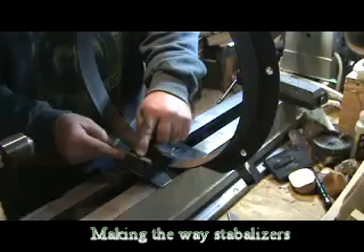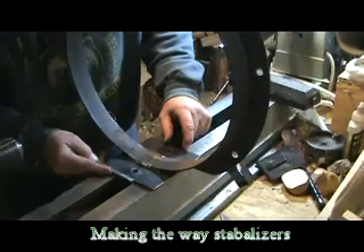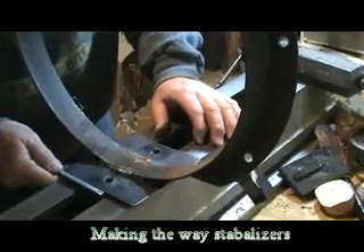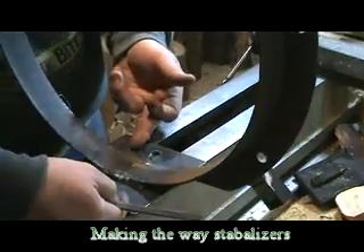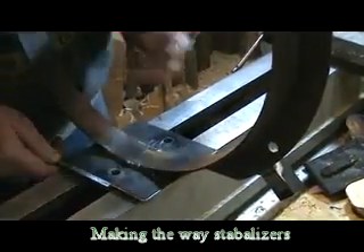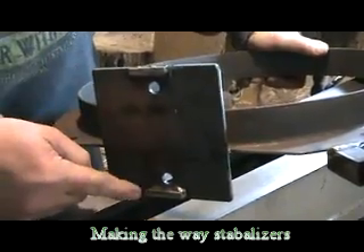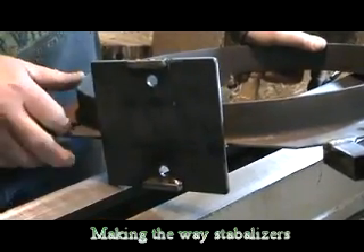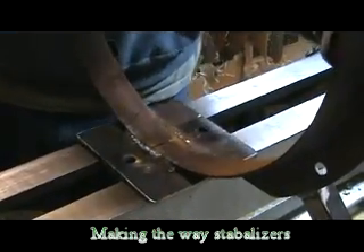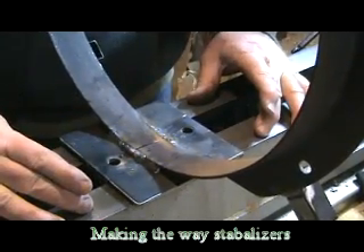I'm going to take a little piece of this quarter-inch square stock and cut it so it fits in between the ways on both ends, so when you set it in there it keeps everything centered and square, and then I'll make the keeper for the bottom that holds it in place. A lot of guys just take one piece and let it spin until it catches, but it can still wiggle around and move — I want to keep it centered and square on whatever I'm turning. I've got the two little bars welded on there. I'll clean this all up and when I paint it, it sits in there just perfect — doesn't twist all around, holds it right in place. Now I'll make the bolts go through to hold it clamped to the ways and we'll be ready to paint.